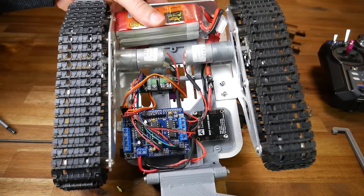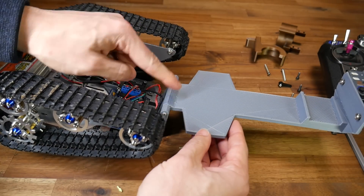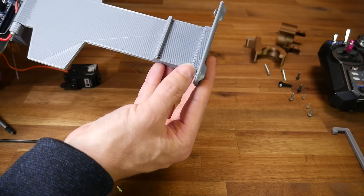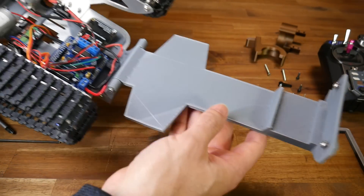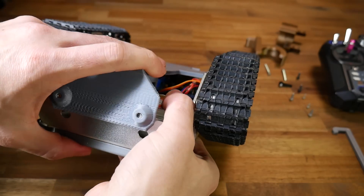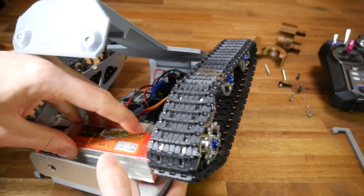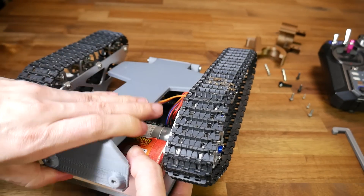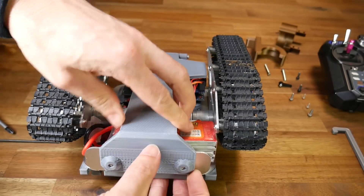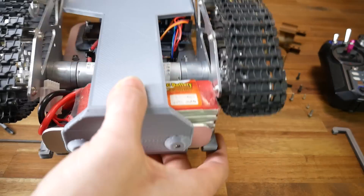With all of this in place, you can attach the lower lid. On the right hand side, it has two long M3 bolts that go through and allow it to swivel quite freely. Down the other end, I have some large M5 bolts — something with a nice big mushroom cap is good — and it closes over, being careful to get the battery in the correct position, and it interfaces with the two holes in the metal frame of the tank chassis. After it clips into place, it's actually really strong. I can pick up the whole weight of the tank by this and it doesn't come undone, but if we flex it outwards just a little bit, the bolts disengage and we can open it really easily.